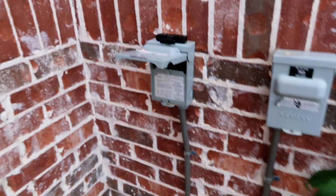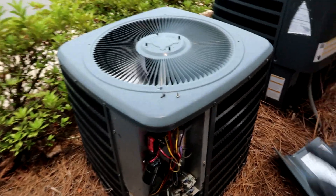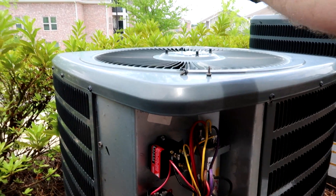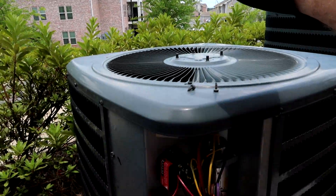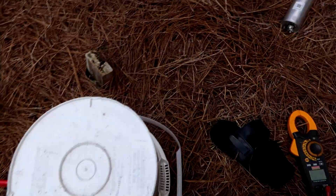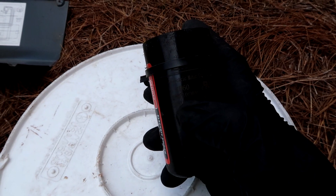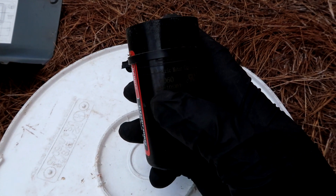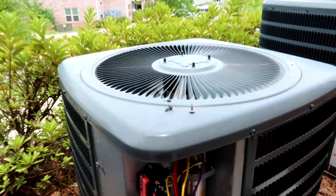Come on big money, no whammy — just want to hear that compressor fire. Oh yeah! I can hear it now — fired right up. Sounds better than that buzzing it was doing. I was turning my unit up here and I heard something going — came on out. That's all it was: bad hard start. The old one says 88 — the range is 88 to 108 microfarads — but if it's around 88 it'll start popping that breaker and buzzing. So anything below 100 I'm changing it out. New capacitor, all good to go — they're going to be cooling now, no more buzzing. Thank you all for watching, we'll see you in the next one.